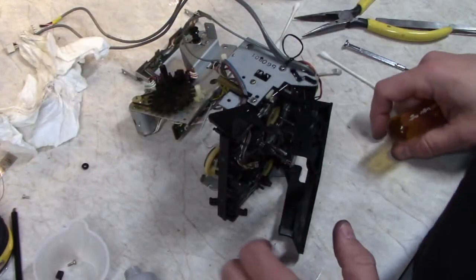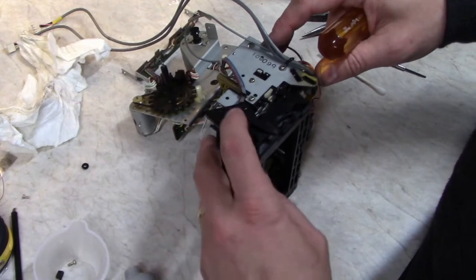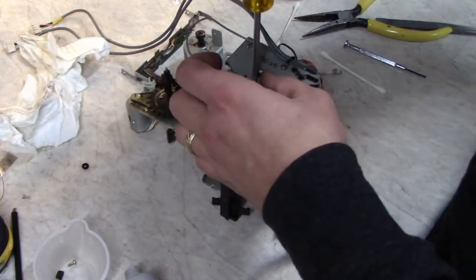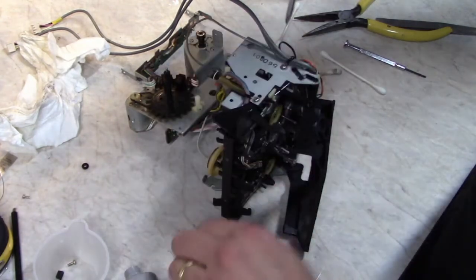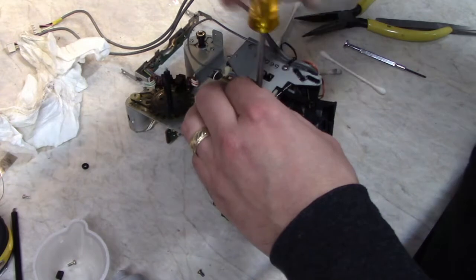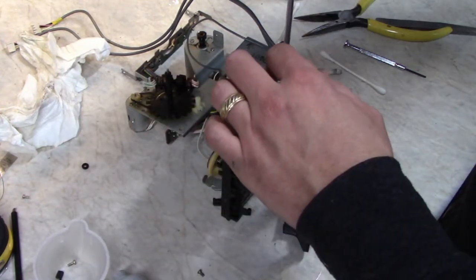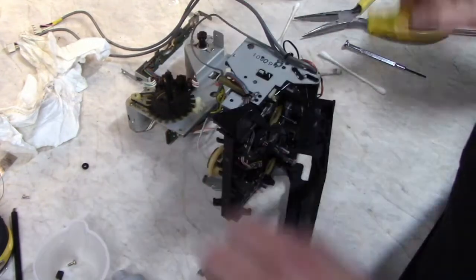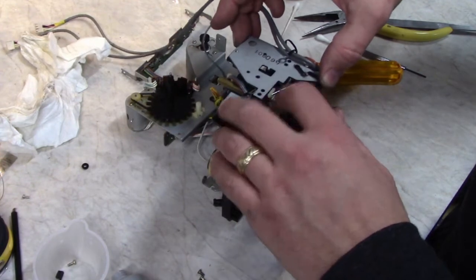If you're the type of person who defines the quality of your tape deck by how slowly the eject door opens, then you can try to treat the plunger dampener that controls the door speed. Now, you might be tempted to pack it with a bunch of heavy grease. That doesn't work. It almost never works. There's a reason for that.